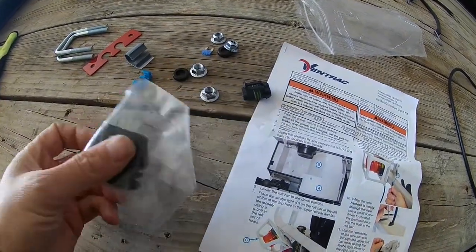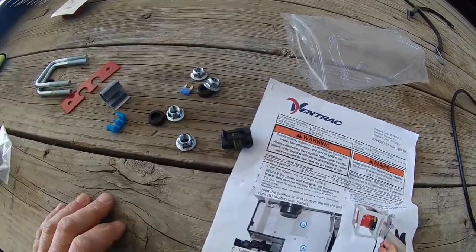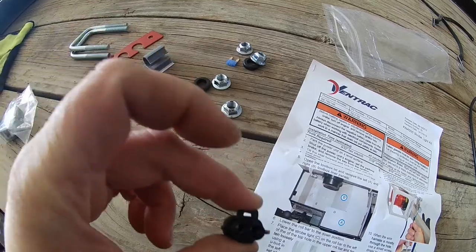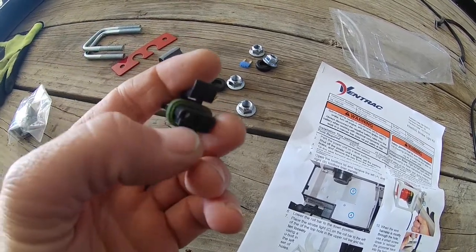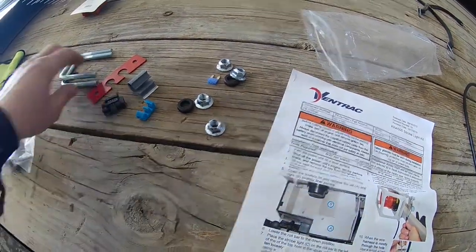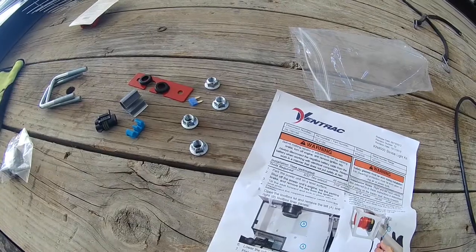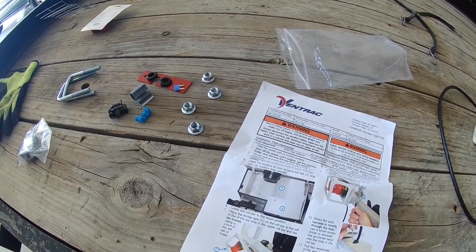When you get the kit, it comes with the switch. Pretty easy — you remove the plug that's in the dash, pull the cable up, plug your switch in, then go to the back of the tractor, move the cover, run the wires through the roll bar, and insert them into this connector that goes into your plug. The dealer told me to make sure you get the right wires in the right holes — if you get them in backwards there's a special tool to get them back out. So make sure you read the instructions carefully. It also comes with a couple U-bolts to mount it and a plate that replaces the solid plate on the back so your wire can come through to go up the roll bar. Pretty simple — doesn't look like anything very difficult to install.